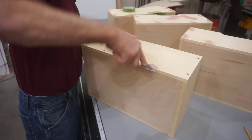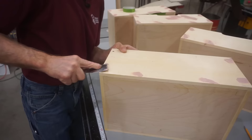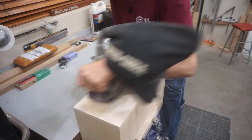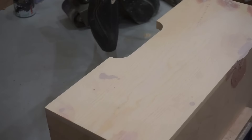I don't know if it shows up in the camera, but each one of these screw heads burps out a little bubble of air when I press the Bondo in — and once that happens, I know the screw head is going to be full. That's why using a putty knife is so helpful: it allows you to get good pressure for forcing the Bondo down into those screw heads. Because I'm going to use a belt sander to sand these repairs flush, I make sure the Bondo is good and hard before I start sanding so it doesn't gum up the belt. I'm using a fresh 80-grit sanding belt.